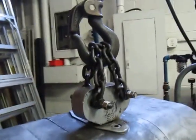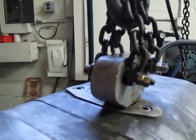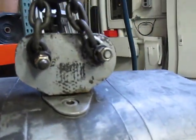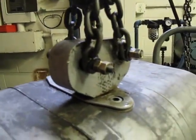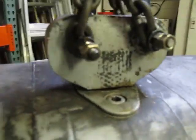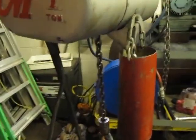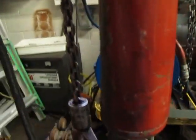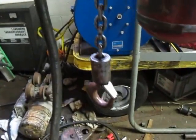While we're waiting for this, I want you to notice the guy probably had a trolley and didn't want to hook it on the trolley, so he came up with this way. I didn't get the trolley when we bought it and I only have coffing trolleys here. This can be replaced with a hook — you just pull out these two screws, this one and this one, and then you get a CM hook. I just don't have the right CM hook here either, but that's a whole other story.